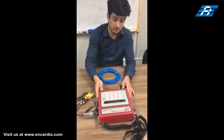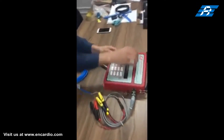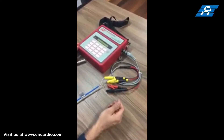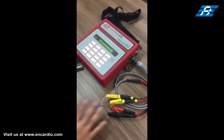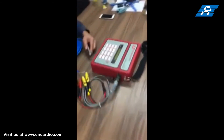The readout unit measures the time period of the resonant frequency and calculates the frequency. The unit has a circular splash-proof 3-pin connector for the battery charger, a 7-pin connector for sensor input, and an RS-232C serial interface port.